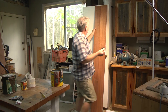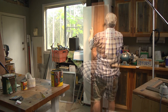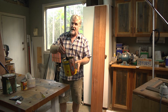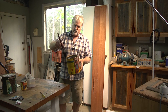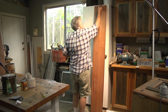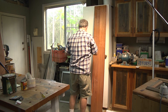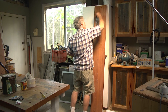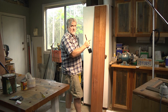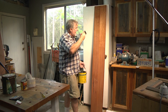Let's do this. Again, edges first, just like yesterday — always the edges first. Also take note, guys: we're not doing this — this is probably one of the worst habits do-it-yourselfers do, and probably half the professional painters too. You're just scraping all your material off. So, here we go. Across the top. I haven't done the top yet, for the same reasons I showed you yesterday. Put it on and you'll notice it goes on a lot easier — the porosity of the timber is not there, this just glides over it now. If you've got too much paint on it, you're going to get sags and runs and drips.